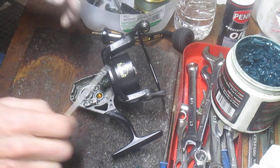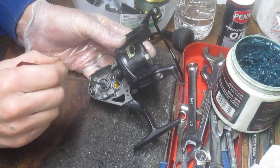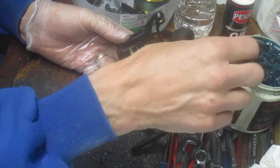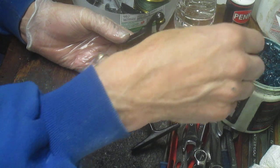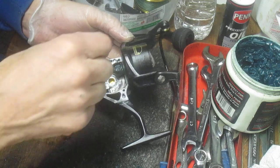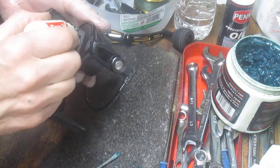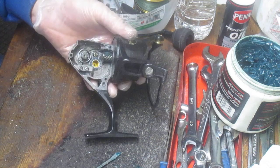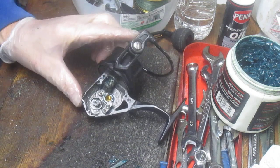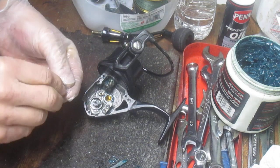So we're going to put it back together now. We cleaned that all out. The case on the other one had a lot of old grease underneath the crosswind gear, so we took that apart. Let's go reinstall it. We're going to grab a little bit of blue grease and make sure that we have enough grease on the pinion gears. I'm going to take a shot at the ball bearing under here with a little bit of oil, and make sure we have some oil on the back bearing as well. Then we're going to grab the smaller of the two crosswind gears.